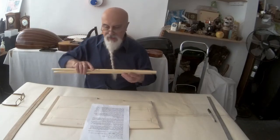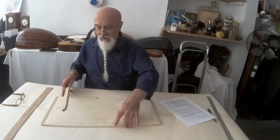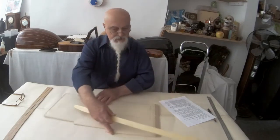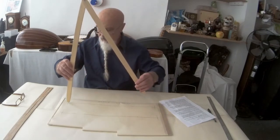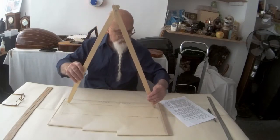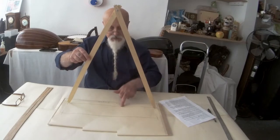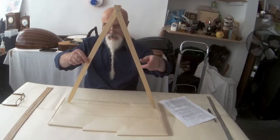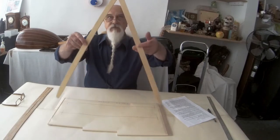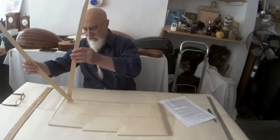So to do a fret layout, it's very quick and simple. I've got a scale length marked on this paper here. So I just take a reading of the entire scale length. So I've set the long points at the scale length. I don't need to know what length this is in measurement terms. It doesn't matter, the process is automatic. I just flip the compasses over and I mark the first fret